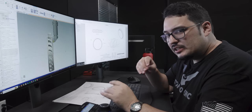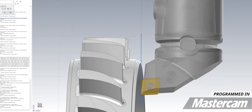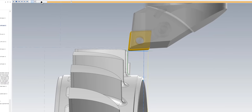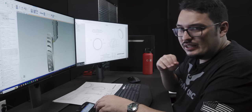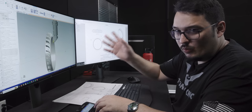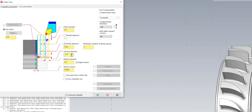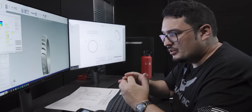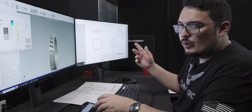One thing with the face pass: I don't actually face down the entirety of the part. I was worried about the top of the holder and spindle hitting the jaws or the top of the part, and I didn't want the tool sticking out really far. So I only go down just enough to clean up, knowing that when I do the ID later all that material I'm missing will be going away. I put a negative 2.5 inches in the overcut amount in the face pass, which keeps it off at five inches in diameter. That's where it stops, then it continues to the OD roughing.